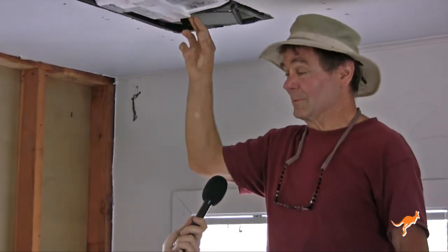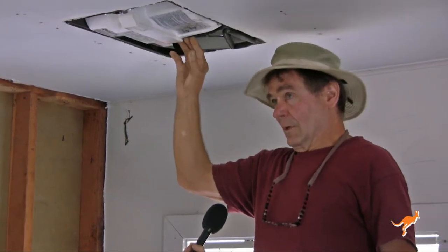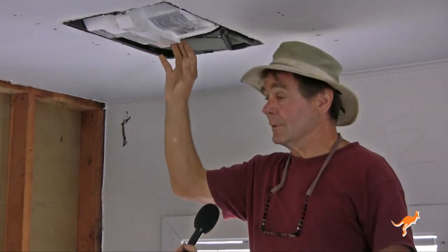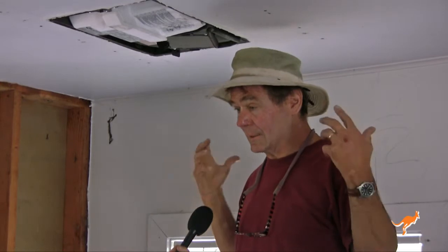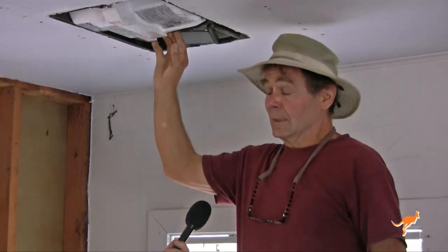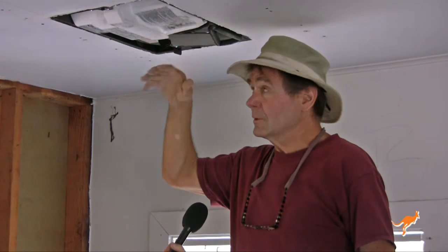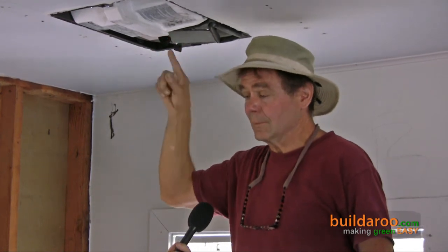This is a really cool thing — it's made by Panasonic and I don't know anybody else that makes a small mini one. In a whole-house system you'd have a larger heat recovery ventilator, but for our application this works really well. It costs about $300 and it solves the air exchange problem without a lot of energy loss. It's also very, very quiet — we ran it and it's just barely audible. I call this the iron lung, because when the house can't breathe on its own, this will. It can have an off-and-on switch or you can run it 24/7. When doors and windows are closed you would want to use this to make sure you have fresh air.